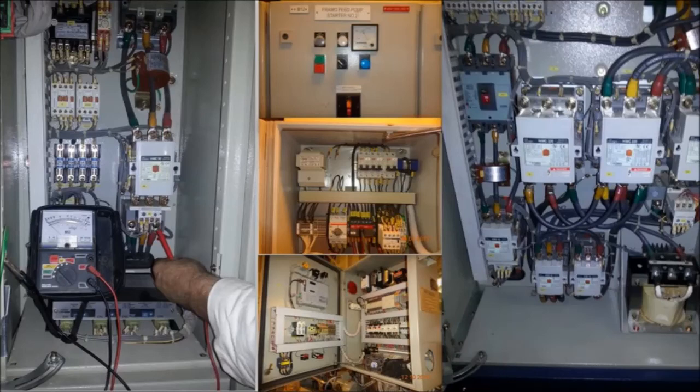The disadvantage of this starter is that power losses are more. Therefore, we use power electronics speed controls in slip ring induction motors, such as slip power recovery schemes, Kramer's method, Scherbius method, etc.